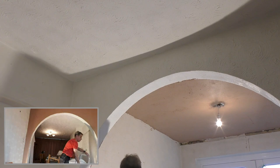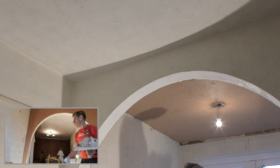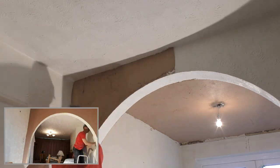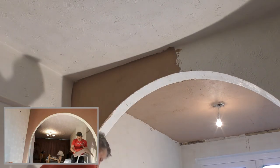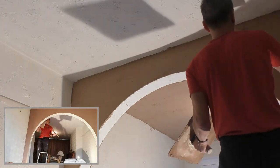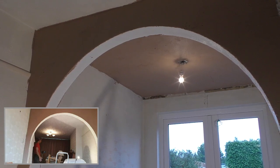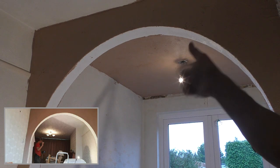Back to this one - I've bonded one side and I'm about to do the other side of this arch the same again. I've speeded up this part of the video since you don't need to see this bit twice, at least not slowly. My technique is to plaster both sides of the arch first and leave the actual curve. That's the bonding done on both sides of the arch. We'll let that set - it's just about used the bag. Letting those two sides set makes it a lot easier to put the curve in freehand.